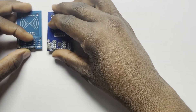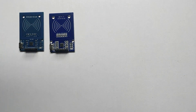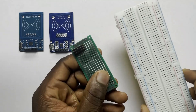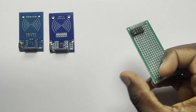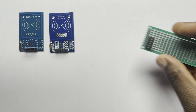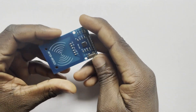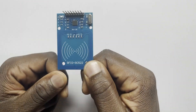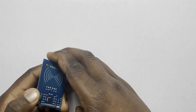We're going to start with our two antennas. These are Arduino RC522 antennas. Usually you connect one at a time, but through SPI they share a couple of pins. That's where our breadboard comes in. I'm using one breadboard which I have soldered at the back to connect all of them in parallel. From the eight pins on this board, they're going to share six pins in common, and one pin will be used to select which antenna will be active at which time.